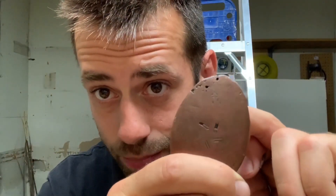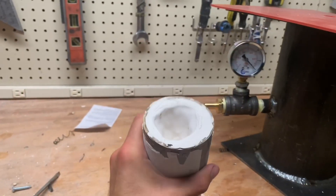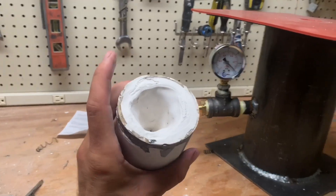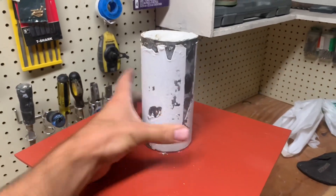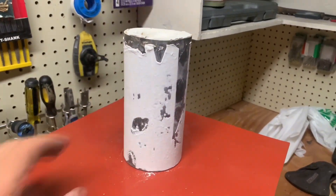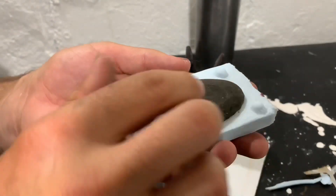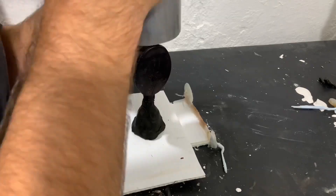Here's why I built this thing to begin with: when I did my copper sanitation bar video, you can see there's still some porosity in there — I cast one in aluminum and it looks like a moon rock. Here's what the vacuum is going to do: I have my investment and it's porous, so when I put it on top and start drawing the vacuum, the air pulls through the column and hopefully it's going to suck out all that little porosity, and I'll end up with a much higher quality cast. To test it, I'm just going to make another bar of copper soap and compare it to the first one.